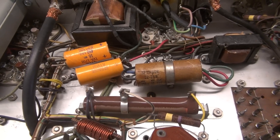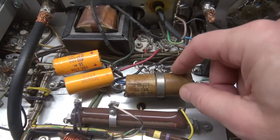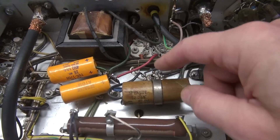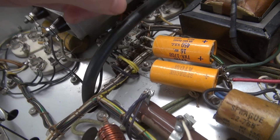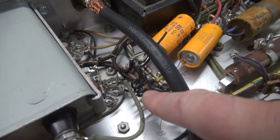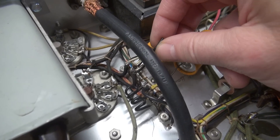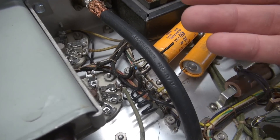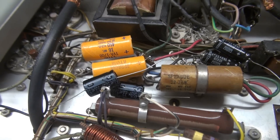Here are the caps I'm talking about — these two 450V units for the low voltage DC, which is around 300 volts, and these two for the negative bias, which is around negative 75 volts. I'm going to go ahead and change all of these. I also noticed somebody cut a wire here — it may be one of the current shunts. They've got current shunts for plate and possibly grid or modulation current, but this one's been cut, which alarms me. I need to find out where that goes before applying power.